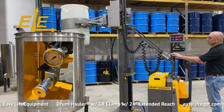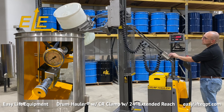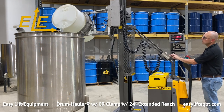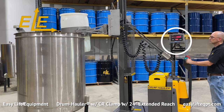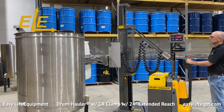The adjustable clamping pressure option permits the operator to lower the factory-set clamping pressure exerted on the drum, depending on the clamp and application, such as when handling lightweight fiber drums or sensitive drums subject to impressions. Optional scale systems are also available for intrinsically safe and non-intrinsically safe areas, permitting an operator to dispense by weight or perform inventory.